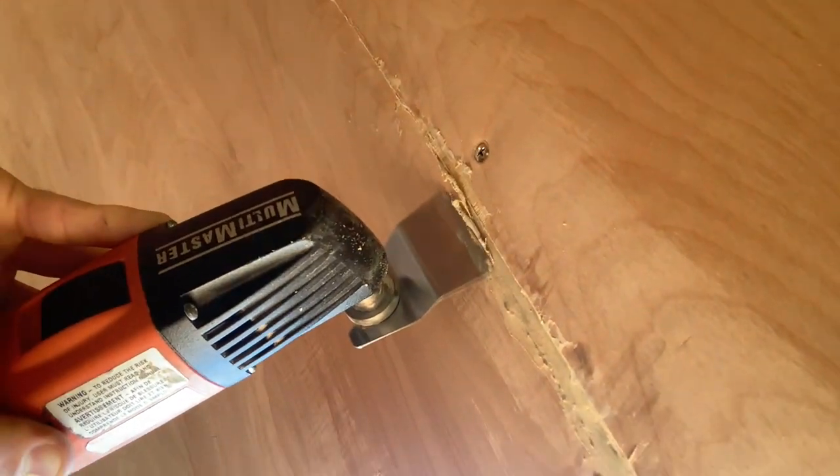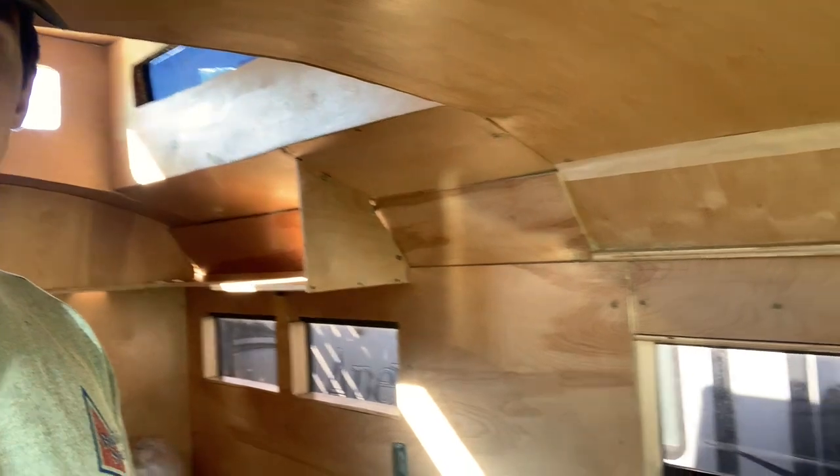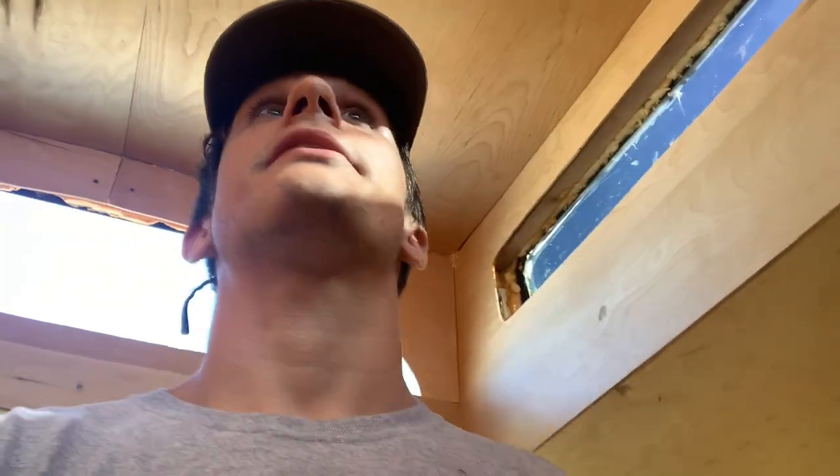Hey guys, happy Saturday. I'm in the bus today and we had some issues with our liquid nails situation. We thought it was going to sand a lot easier, but it doesn't go down very well. So I'm using the scraping tool to take all of it off and then I'm going to have to go back over and sand it. I'll be honest — it did its job, it filled in the gap. If I was to do it over again, I would use it more like a wood filler. Finishing up a little bit of sanding and scraping and then continuing with the coat of poly or lacquer — it brings all the wood to life. Look at the greens and stuff, it's amazing. It's really starting to get a vibe in here, I'm excited about it.